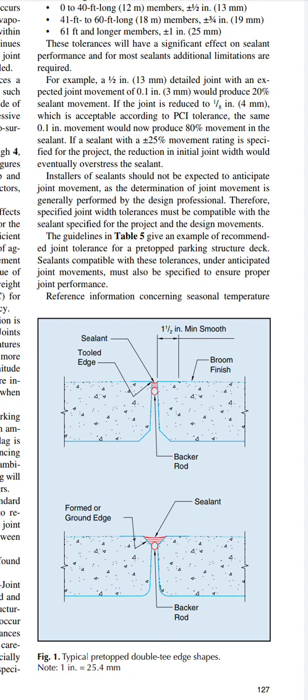What if we load an area more so and expansion takes place on the left side compared to the right? If we load an area of concrete more so on one side — say the parking area — than on the other side, and the temperature comes up equally, will they react the same? One side weighs more than the other — more than the pool deck and planter side. Because it's trying to expand and hitting a heavier force, then we have our huge cycles of temperature ranges in Florida.